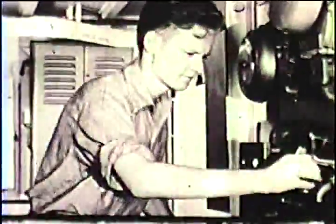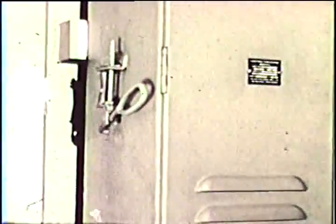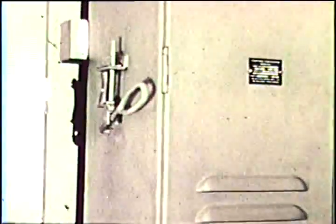Have the electrician start the standby exciter manually. The electrician pulls one manual starting lever, and if the motor generator set does not start, returns it to off. Then pulls the other starting lever. Never pull one lever while the other is on. This will jam and perhaps break the interlock.